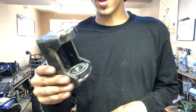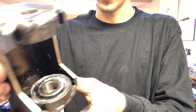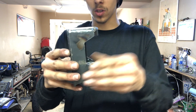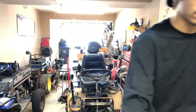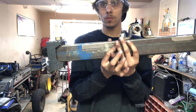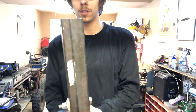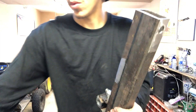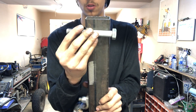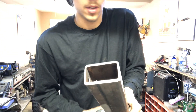After much effort, welding and testing, I got a knuckle. I'm gonna end up welding my spindle off of here - so the axle's here pivoting, my spindle's gonna come off of here and then over. This is my knuckle and then I'll have a spindle as well. Right now I only have just a slight bit of turn because on this end it's a nice square, so I need to round this off on the end so that this unit can actually steer around the square post. I'm running my 5/8 bolt through here.